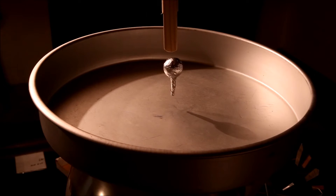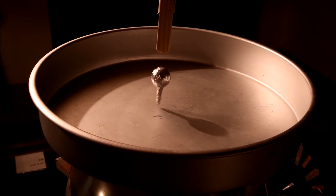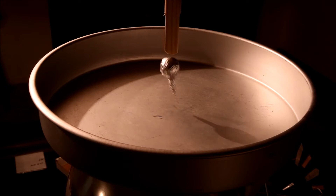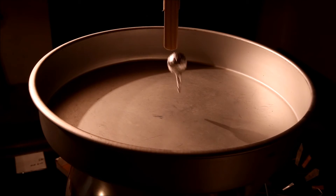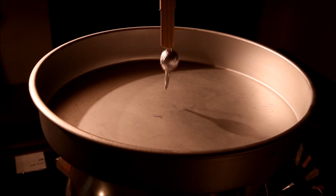The biggest problem is finding the sweet spot for the speed at which the Van de Graaff generator is operating. Too slow and not enough charge is being created to let the object be thrown upward. If it's too fast, it becomes unstable — it bounces too much and is even ejected from the cake pan. For my Winsco NV100 Van de Graaff generator, I found about two-thirds power is the best setting.